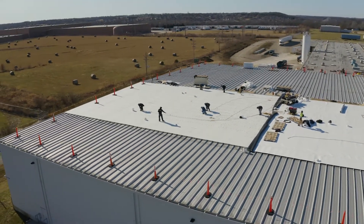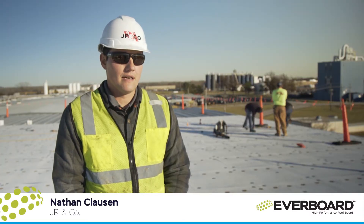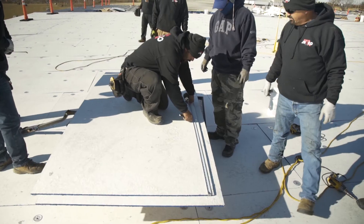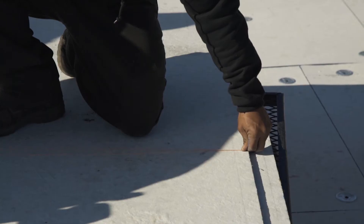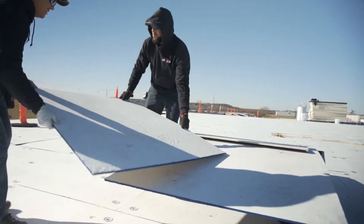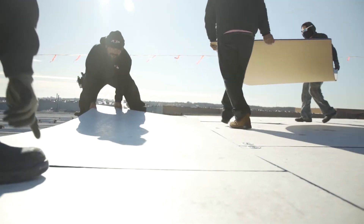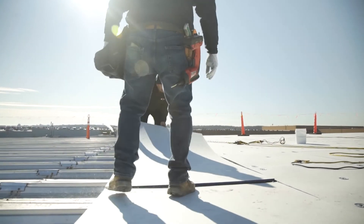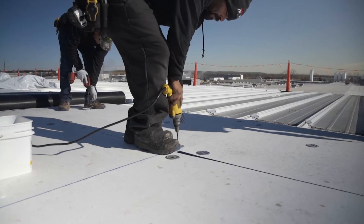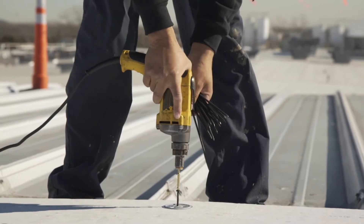Right now we're on a trapezoidal seam metal retrofit, and this does not require the VSH rating, so we're just going to go at this with SecureRock. After talking with the crew, they really liked using the product — it seemed to span gaps better, and you didn't have the breakage like you can sometimes have with gypsum-based products, so it was a no-brainer to change the scope.